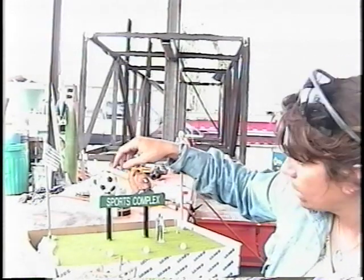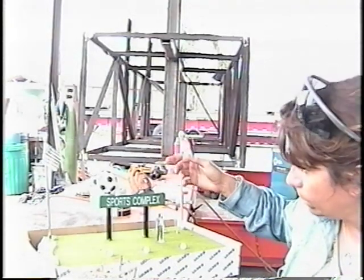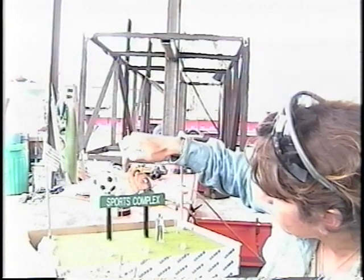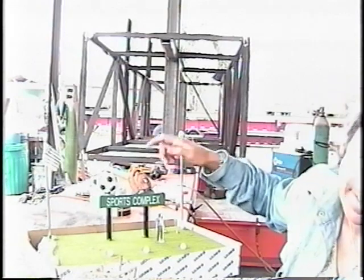We're doing our large beams and members that will be holding the heavier elements in the sculpture. These get into some pretty complicated angles because they're traveling back and tying into each other. And oftentimes we have to place kickers to again bring the load back to our big pieces of steel. And today we're working on the mitt area, and the last member we'll put in now is going to be the bat, and we'll tie our mitt into the bat at that point, and that'll resolve our structure.